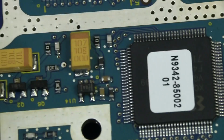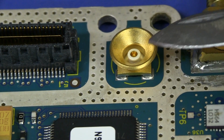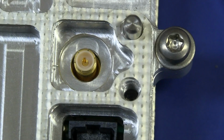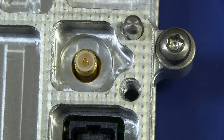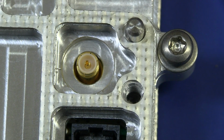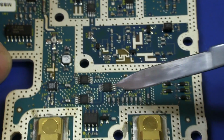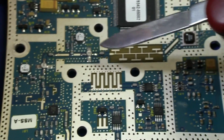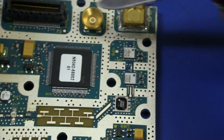We have our board-to-board interconnect, of course, there, and check it out, we have a board-to-board RF connector. Doesn't that look funky? Geez, ET could phone home with that thing. And there we go, there's the made-in RF connector through there. So that's probably getting one of the local oscillator signals or something like that over to our tracking gen. And that's where we follow the signal around from our output way back here, through what looks like a bandpass filter, through some local oscillators and stuff, and back over to here.